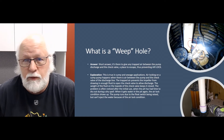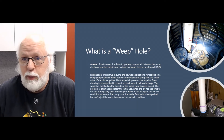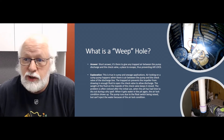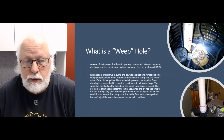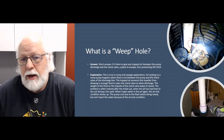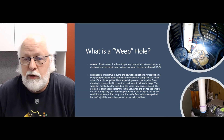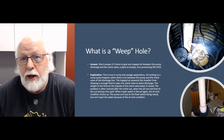I've heard from plumbers that have been in business 25 to 30 years who have never heard of what a weep hole is — people that haven't drilled it are usually lucky if they haven't had a problem. But again, it's more of a preventive measure, so you should do this in sump and sewage applications. When you do your annual maintenance on your pumps, that might be something to check — make sure that hole is not getting clogged up.